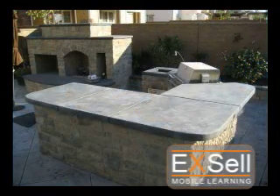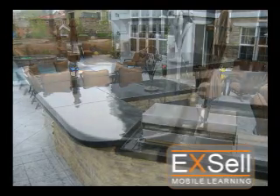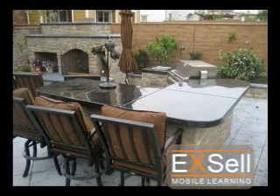5050 Polytop is a unique polyurea coating that is enhanced with nanotechnology to improve its resistance. It is a self-priming sealer and two coats are all that's required on most countertops. 5050 Polytop is also a low VOC product with a rating of less than 10 VOC.